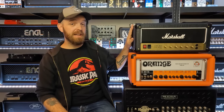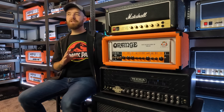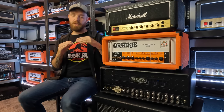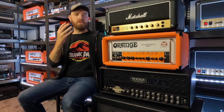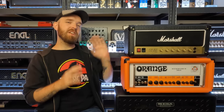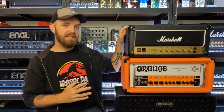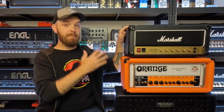That was quite interesting. So with this particular amplifier, the difference between the volume levels is quite drastic. So the effect on the tone of the amplifier is quite drastic here. The EL34s really start to smoothen out the top end, so the amp definitely gets darker with the louder levels. There's more saturation and compression as well. I personally think that it's a little bit too dark with these settings, but this really does illustrate what starts to happen when you crank this amplifier up.